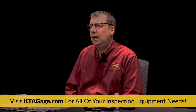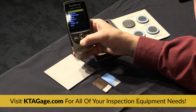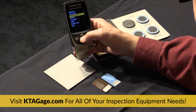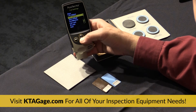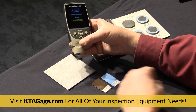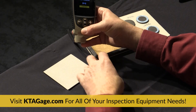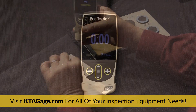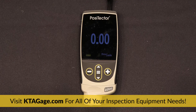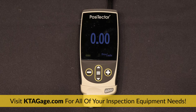The fourth item you really need to have is a reliable dry film thickness gauge. Nearly every project will include measurement of the thickness of each coat once it dries. There are a variety of both magnetic pull-off gauges and electronic gauges to choose from. The electronic gauges are faster, more accurate, and can be used on both magnetic and non-magnetic metal surfaces. They can also be adjusted if necessary.